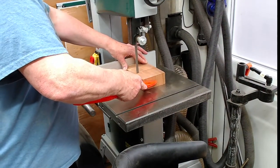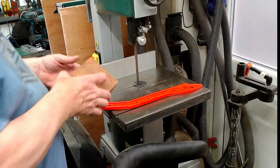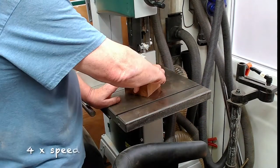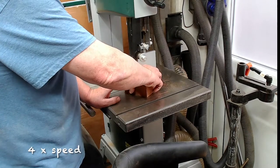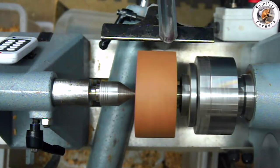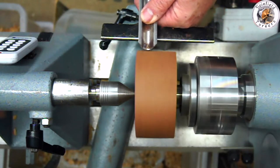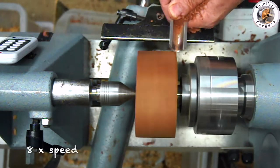I've got this piece of African hardwood which I think could be padauk or a variant thereof. I'm cutting it into about 100mm square and about 50mm thick — this is going to be the feature platform and top of the lighthouse. This cap has got to have two mortises: one that meets the 50mm tenon on the base, and one that's 47mm to accept the glass cover for the light.